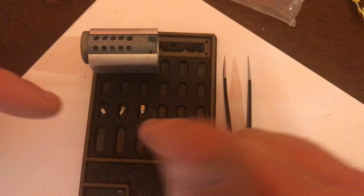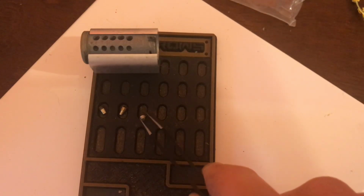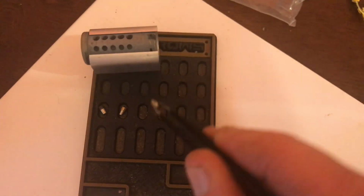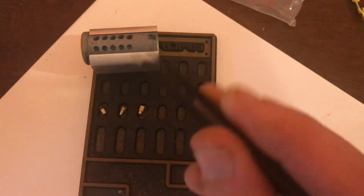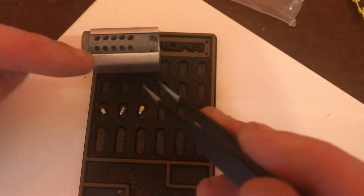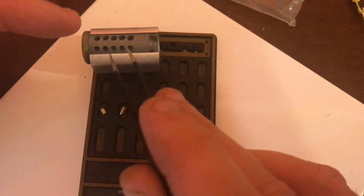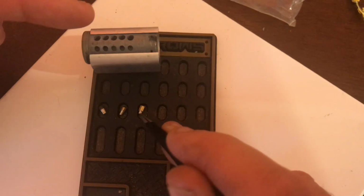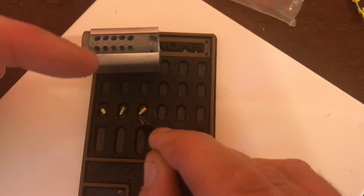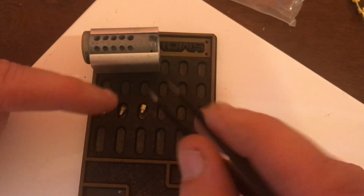Just a quick little look at the humble T-pin. They're quite simple and clever, and they can be very effective. If you've watched any challenge lock videos, you've probably seen a few of these come into play, and they can be a little bit tricky, just because if you can catch that little tip, it's very easy to get it lost up there in that shear line. And the higher it's tipped up in there, because you've got a little bit of wiggle on the key pins and you're applying tension, which is catching the tip, it can be difficult to get the key pin to press on it well enough to dislodge it, depending on how everything works and flows together in your lock.